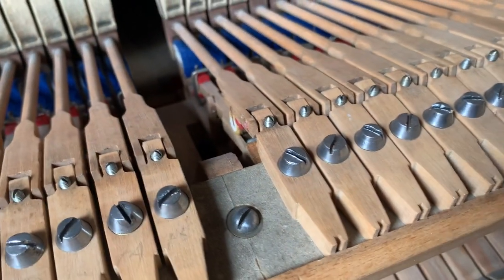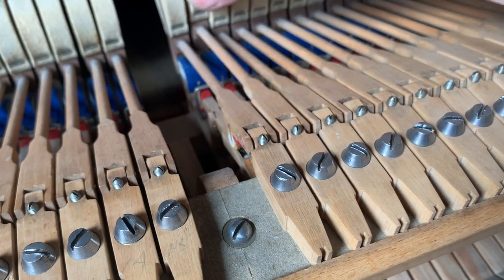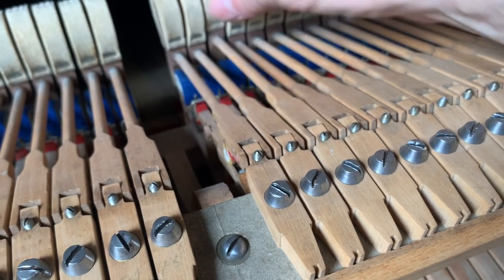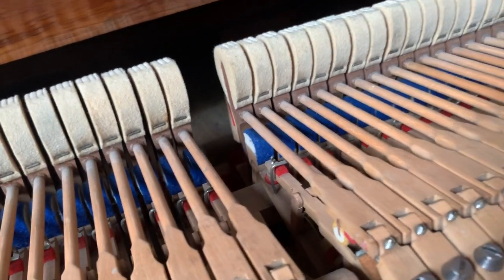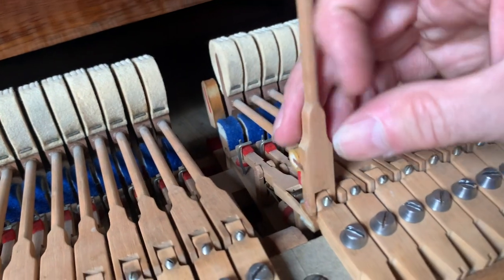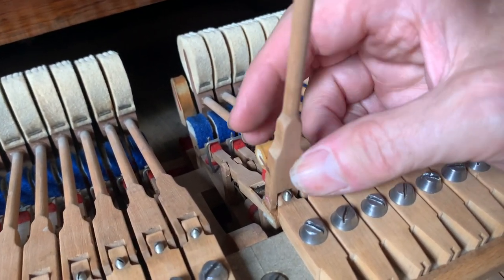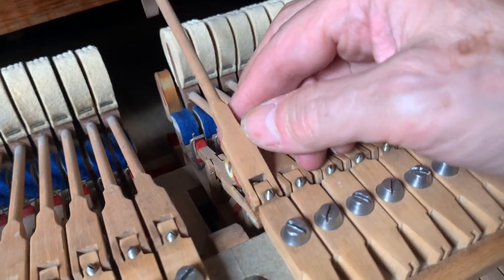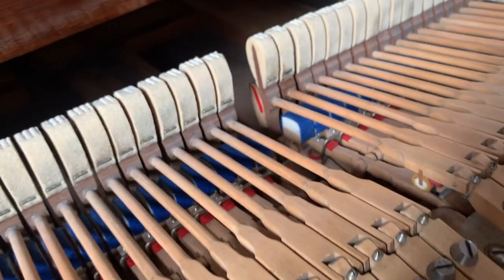And the shanks, there's a looseness here. So if we look at that, you can see them moving sideways a little bit. So that's making a noise as well. So no doubt about what we would do with this one, which is change hammers, shanks and rollers, as we mentioned many times before. This roller here, this knuckle, it needs changing, and then that needs lubricating with dry lubricant afterwards to keep it nice and smooth. Well, I've mentioned these things before.